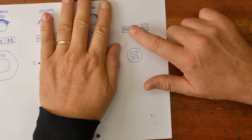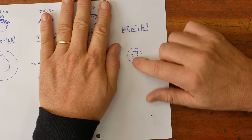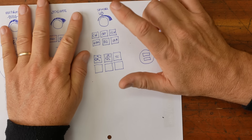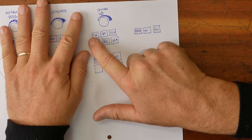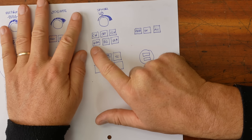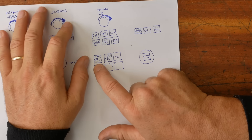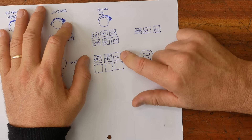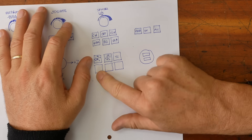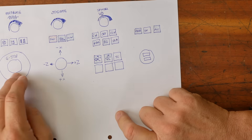This block is simple — just coolant, flood and mist. And this is where I'll put my USB port, which does have a cover over it. Over here I'm not quite sure what I'm going to do completely. So: a spindle speed override button, spindle start clockwise, anti-clockwise and off, then buttons for bias variator down, bias variator up, engage or disengage the back gear, tail stock engage, tail stock release, some sort of automatic tool change, a switch to the next tool button, and then three spares I'm not sure what I'll use for yet. I haven't put any collet control on the panel because it's already a foot switch.